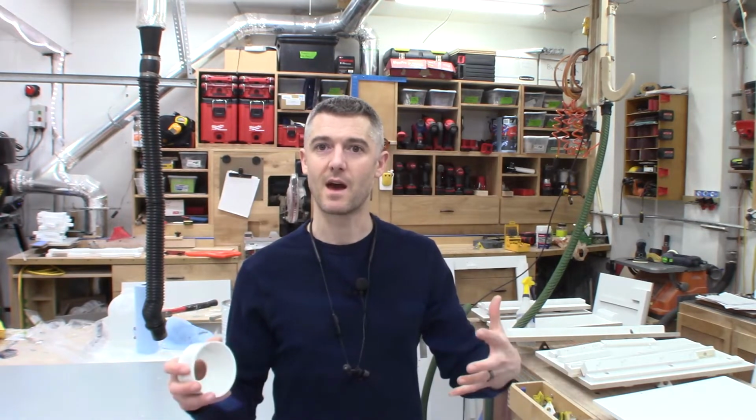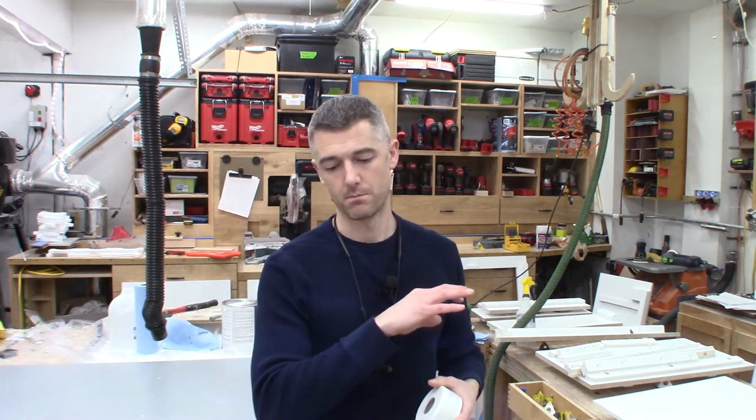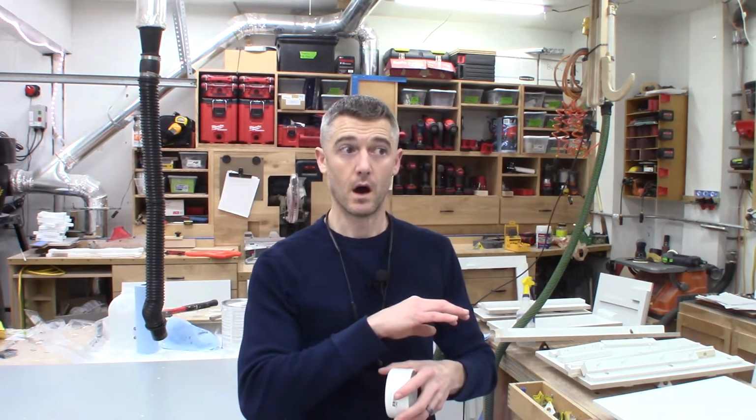Alright, a number of things going on here. First off, all the interior pieces have been primed and painted. The interior gets painted because MDF is actually porous. People use it on CNC tables with their vacuum table because it'll actually pull the piece down to the table. So that's why they have to get painted, to block the airflow going through them. That's all been done. The exterior has just been primed. After assembly, that will get patched, primed, and painted, except for the bottom. The bottom is getting painted first.